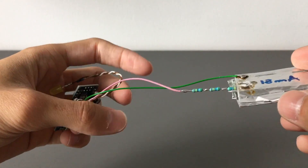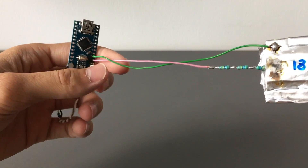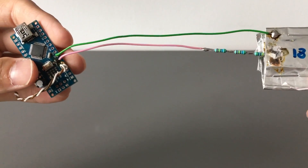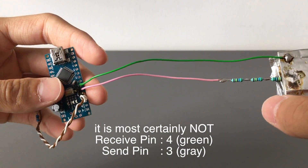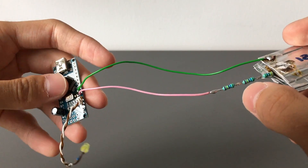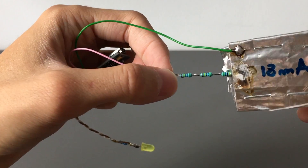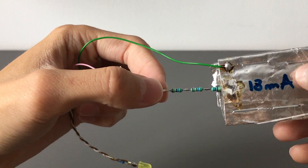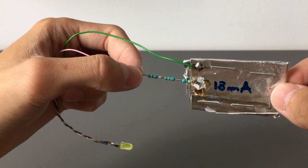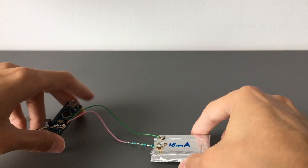The way you connect this: there is a library I'll show you in a minute. You define a send pin and a receive pin. The receive pin is pin number 3, going through very high value resistors. I have three times 5.5 megaohms, so 16.5 megaohms total. The range is between about 1 megaohm and 15 megaohms — the higher the resistance, the more sensitive the touch area becomes.